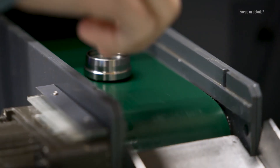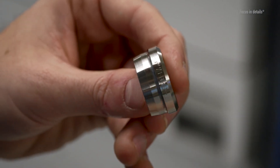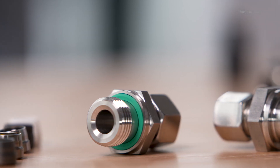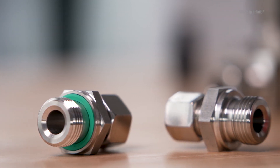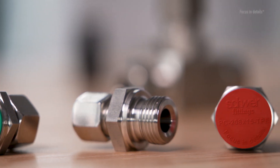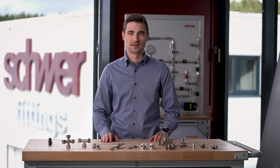We have a comprehensive selection of other cutting ring variants for critical process parameters. Depending on the area of application, the body is available in many design variants and with different tube and thread connections. All threads are fitted with protective caps on delivery. The precision-turned conical surfaces guarantee an optimal sealing function and perfect sliding properties. Large metric spanner flats enable secure installation.